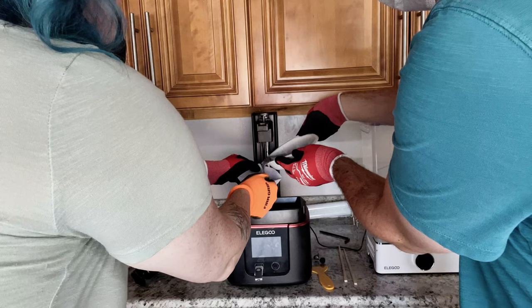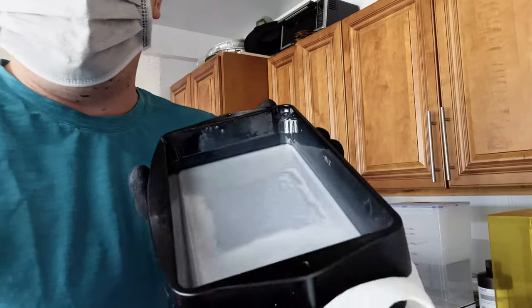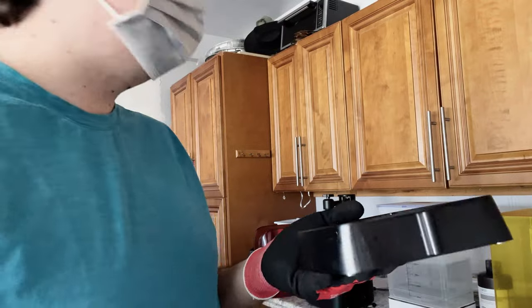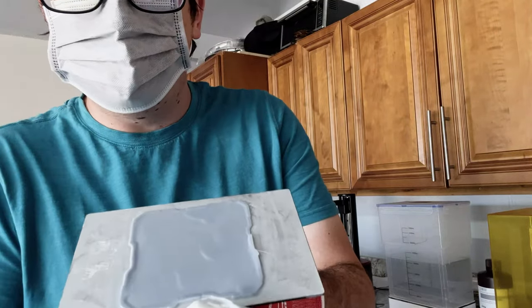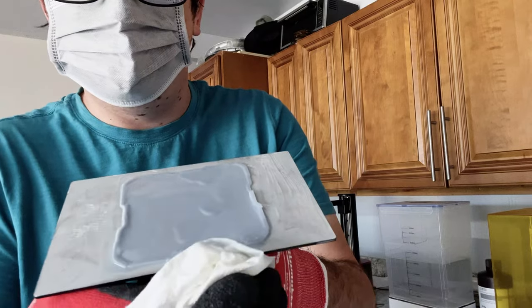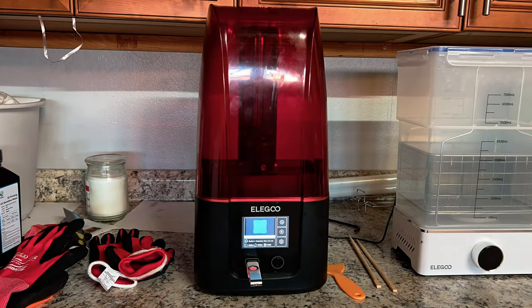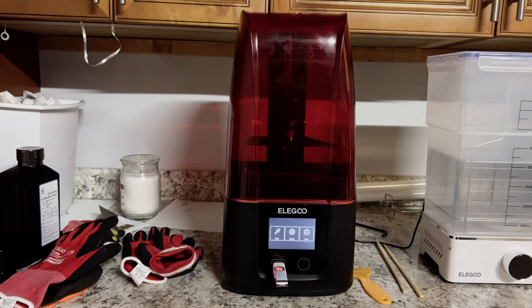So what we're going to do is also filter the resin. It looks like at least part of it printed but didn't stick to the little base on the build plate. Here's the support base we added, so it's probably not an exposure time issue — the base stuck. With everything else accounted for, we went back to the computer to edit the model for the cube and add drainage holes. And then we tried printing the cube again.